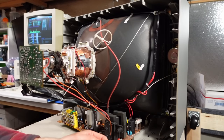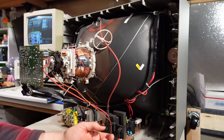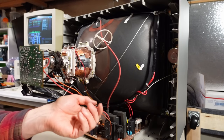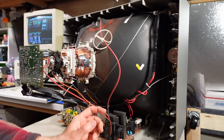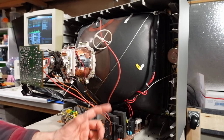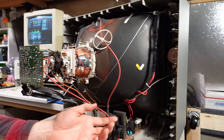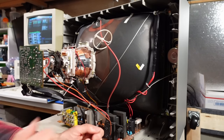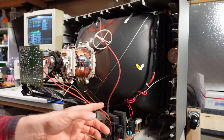Well, something that happened in the CRT heyday at the end was something called velocity modulation, or scanning velocity modulation, where it did this artificial sharpening on the dark to light transitions, I think by slowing down the scanning of the beam or something weird like that, like it would slow it down briefly and then speed it back up again to artificially sharpen the edges to make it look more high resolution or more high definition or whatever. I hate that.